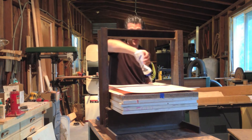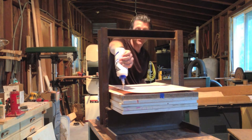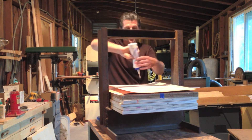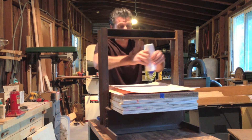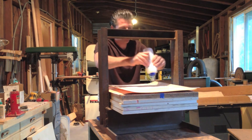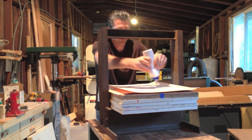You can see that this will really take a long time to cure out — this much water-based glue inside this assembly. So it'll stay in the press for two days. And even after it comes out of the press, I'll clamp it in a bit of a form to keep it from warping as it cures the rest of the way for even a few more days.